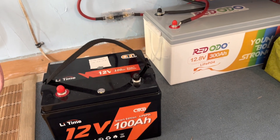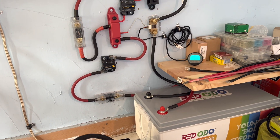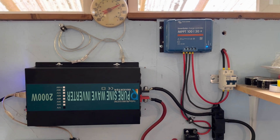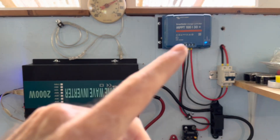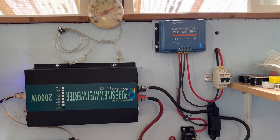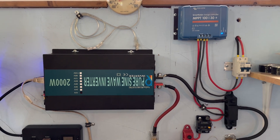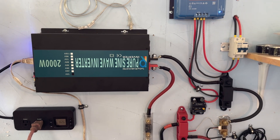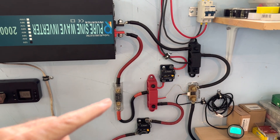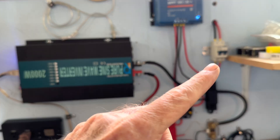So I had to conclude that test. Then I wanted to tell you what happened after I slid that one in — I ended up popping a couple of fuses. I'll do a short review of the system we're working with right here before I show you what happened with those fuses blowing. We've got this MPPT from Victron solar charge controller, 100 volt 30 amp, tied into a 2000 watt pure sine wave inverter from Reliable Electric. There are a couple of fuses, some breakers, another fuse, and a solar isolator switch.